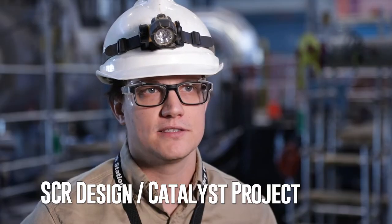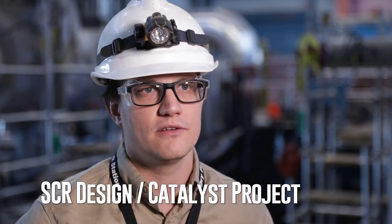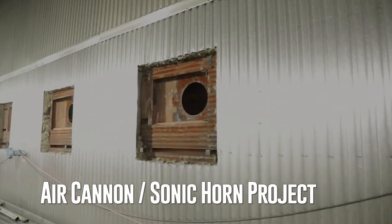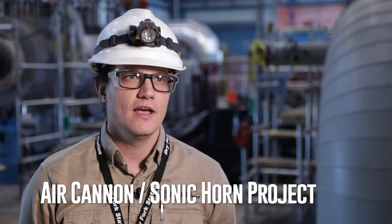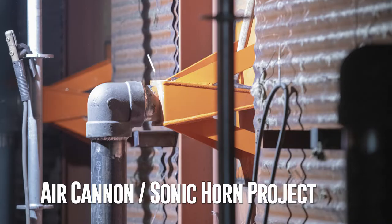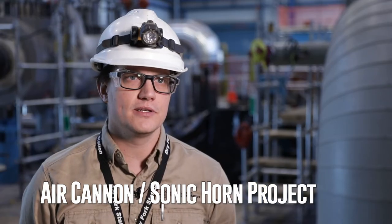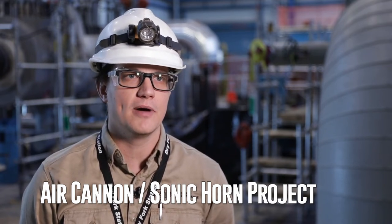It's not a quick outage — if they can't meet NOx requirements, it's a few-week outage to get the catalyst replaced and get back to full load. Along with some plugage issues Dry Fork is having, we're adding cleaning equipment: 15 air cannons, moved 5 of them, and rearranged about 12 sonic horns and added another 12. The air cannons and sonic horns provide a burst of air that throws the ash back up into the air stream, getting it back into the flue gas and carried back through the catalyst. We're getting our cleaning arrangement to where it needs to be to prevent plugage and make sure the catalyst lasts the full three years between outages.